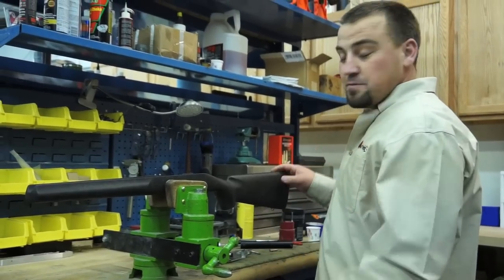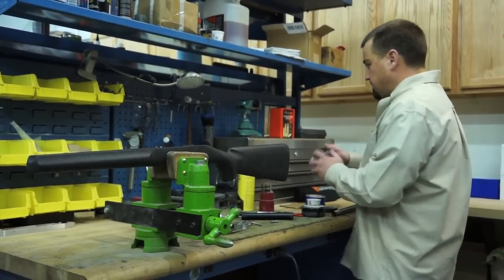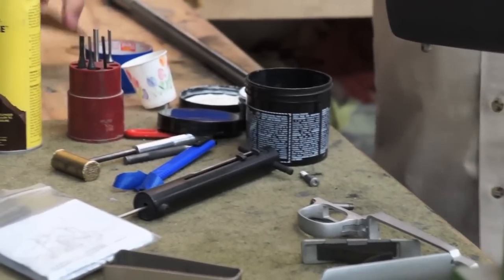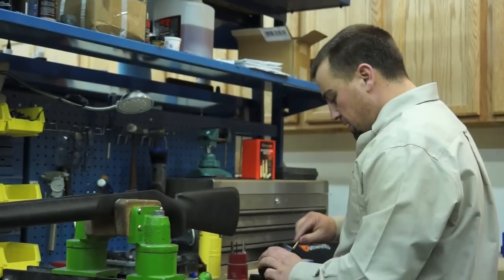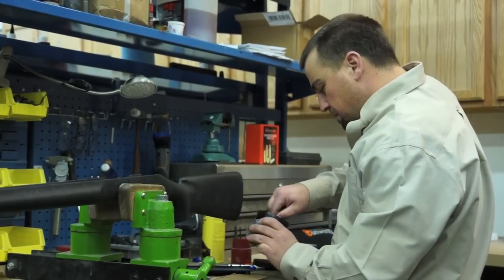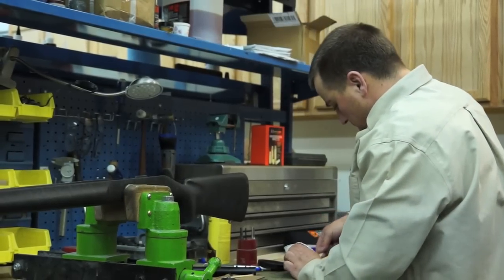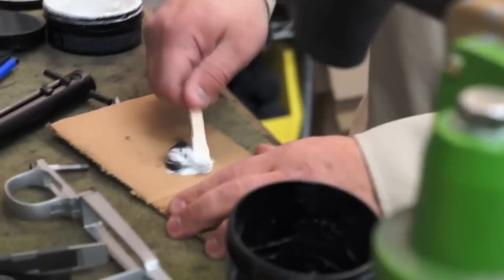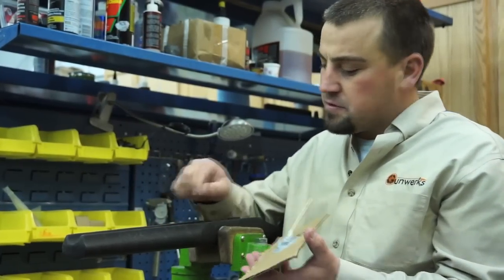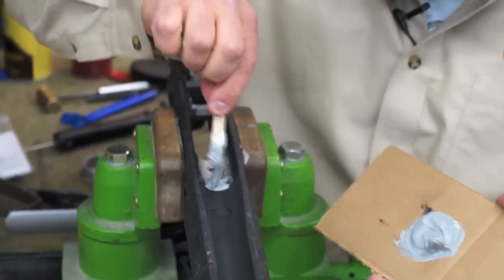You want to do that before you mix your glue, because if you don't, sometimes you forget to do it altogether and then you can't get it out. Depending on what epoxy you're using, just follow the manufacturer specs. If you don't want to wait, use an epoxy that dries quick — just be ready for it. This stuff I'm using right here is a two-part mix, so as soon as we mix it up we'll have to get going. Now there's a tendency to put too much in there — if you do, it's going to go all over your stock and over the sides. All we need to do is fill up that little gap in the recoil lug area. It doesn't take very much, just enough to fill up that hole.